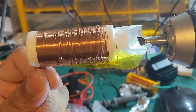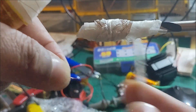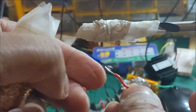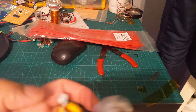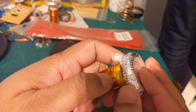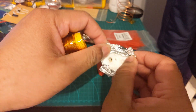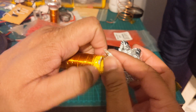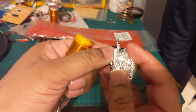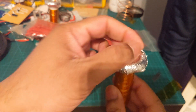The winding coils need to be fastened with a roller — in my case I was using a water filter that looks like a pipe. Make sure they don't fall off, so as you go along just put some tape across. The secondary Tesla coil requires parasitic capacitance. For my project I used a simple 3D printed part, put some kitchen foil on top, wrapped it around, then glued it and made sure the conductive element is connected correctly. A successful parasitic capacitor has been made.